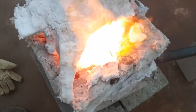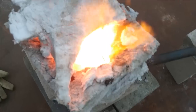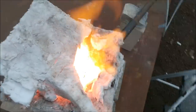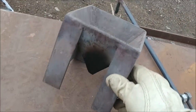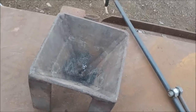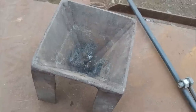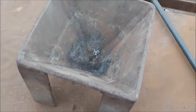I've pulled back the cover — probably can't see anything in there, but the crucible's in there, it's getting up to temperature, getting nice and hot. So here pretty soon we're going to pour this into our cone mold, which is right here. This is just a steel cone that I've made. When you pour the charge in there, the gold is the heaviest, so it goes to the bottom and all the slag floats on top, and we should get a little gold button at the bottom.